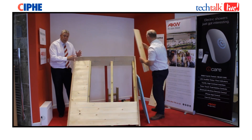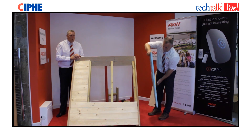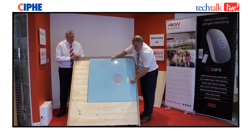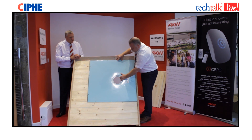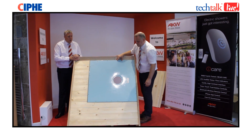Once you've removed all the floorboards, it will be time to put the tray back in position to work out where is best to actually get the waste. Often the waste is offset so it will actually avoid joists, so you can work out the exact positioning so it doesn't clash with the pipework or anything below it.